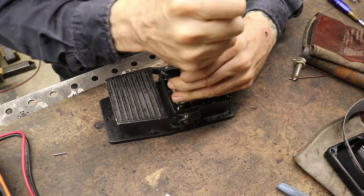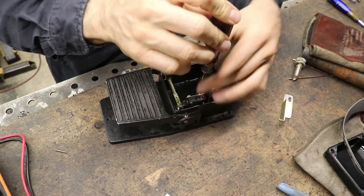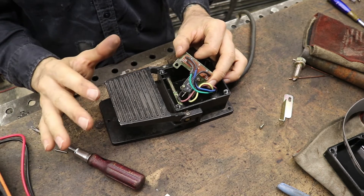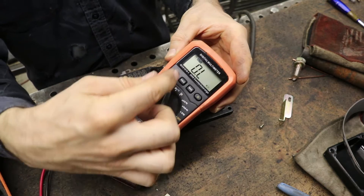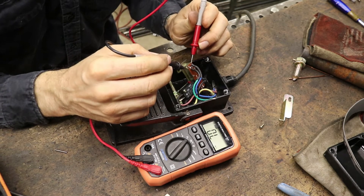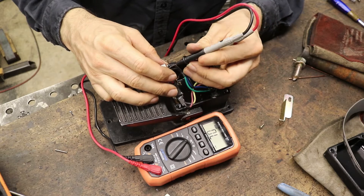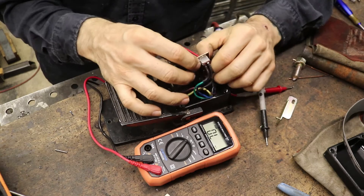We've got to take stuff apart here first so we can get to the wires. Now you can see on mine this is our potentiometer, the back side of it. We've got two wires here, a green and a blue, and then a black on the bottom. Other pedals are going to vary, but if we test those wires — pull out our ohmmeter, set it to ohms — and we go between the green and the blue, operating the potentiometer sliding up and down, it reads 10.5 on one end and zero on the other. If I switch to the green and the black: 10.5 on one end and zero on the other. The potentiometer works.